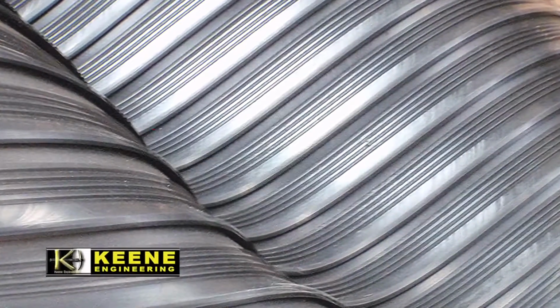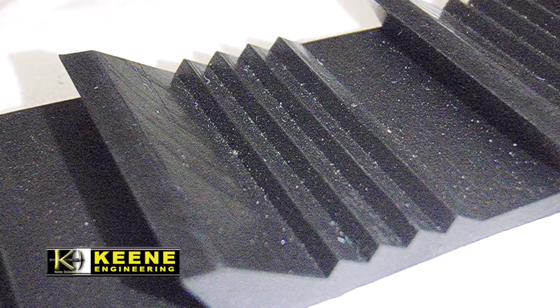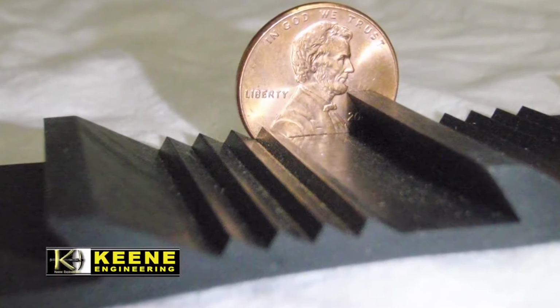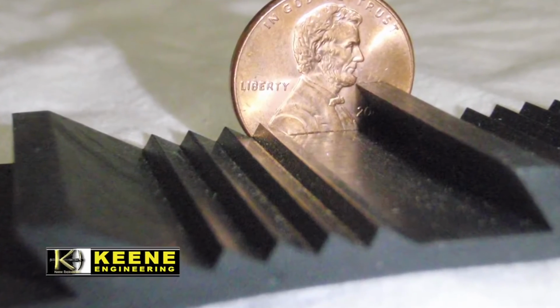We've been experimenting with this box over the last couple of years in Alaska. My friend Bob has also been working on our new rubber riffles and putting them through the test to make sure they can handle the garnet sands, because garnet sands are really difficult to separate, since the specific gravity of the garnet, I think, is about 4.5. The iron's generally a lot smaller and the black sand filters out, but with the box this wide, it's pretty hard to get rid of any of the black sands. And you know what the old saying is, the more black sands you have, the more fine gold you're going to have. Basically that's what we're trying to achieve with this box, something real wide and real long.